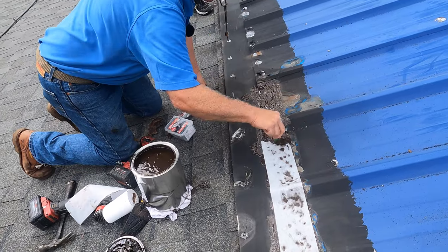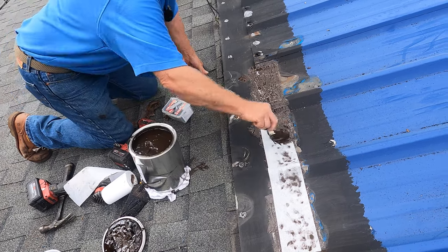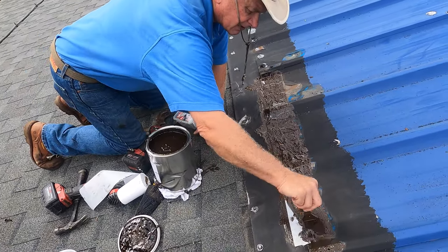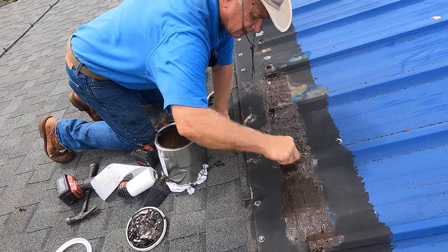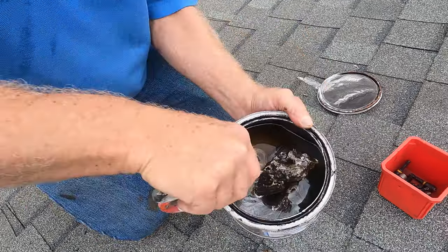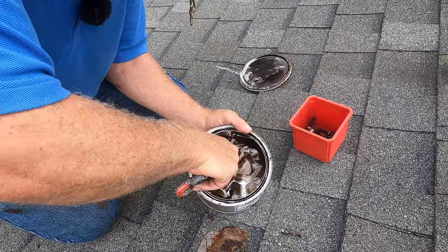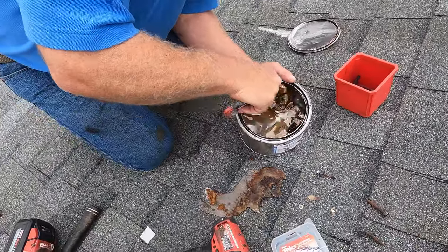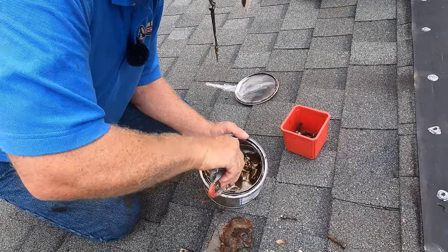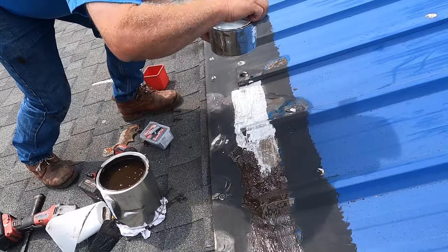You can do silver coating on this. If you're going to paint it blue — I don't know what type of paint that is — if it's oil-based it would be better. You want to protect it against ultraviolet because it will not last more than eight to ten years without it. The silver settles to the bottom so it takes time to mix up. The asphalt is the bonding agent and the aluminum in the silver coating is the reflector and protector.